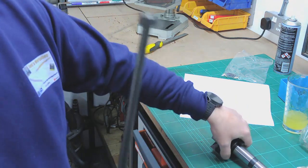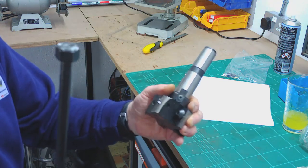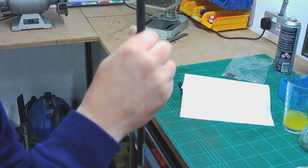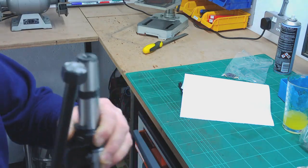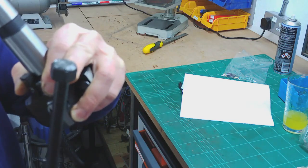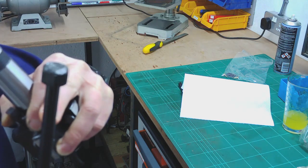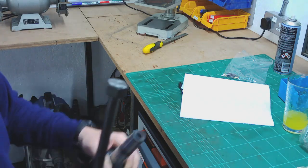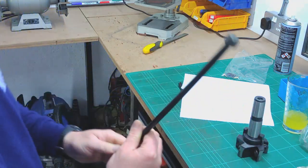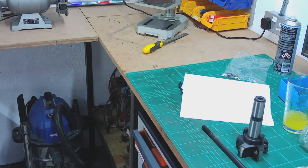What I've done is I've stuck it in the spindle, and I've just used this for now, which is the face mill that came with it, and I've pushed the face mill up into the bottom of the taper, and at the top I've measured the gap between the underside of the nut here and the top of the spindle, and it's about 25 millimetres. So there's 25 millimetres of thread engagement at the bottom. So based on that, I've come up with a design that I think is going to work,